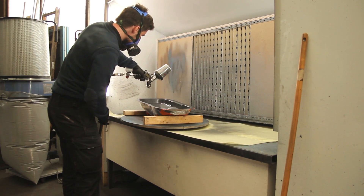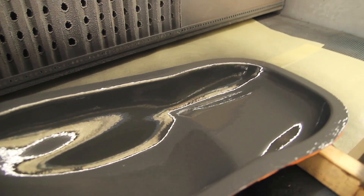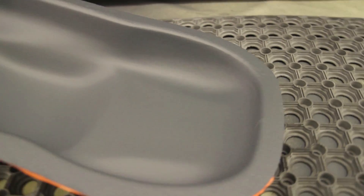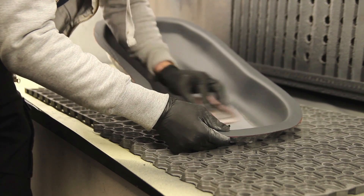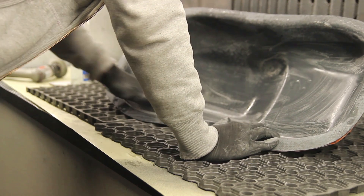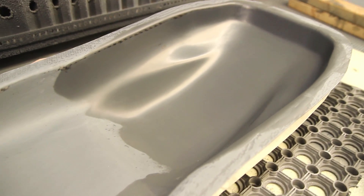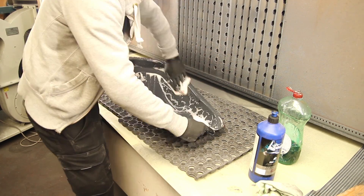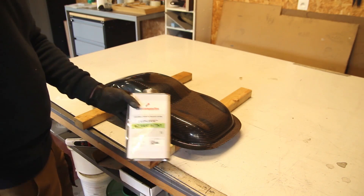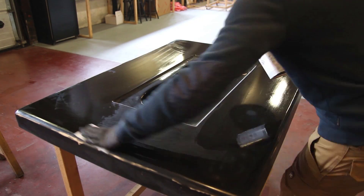Here it's all about adding the pattern primer again — I used it in the first video to make the plug, and now I'm using it on the inside. I'm just trimming the sides, leaving a little bit of cured fabric flange, because this will also be in the layup of the part in this mold. I've sanded it fully flat, applied the first layer all the way back to the carbon fiber so the peel ply finish was removed and any imperfection filled. Now I'm using a spray gun again for an even coat, then wet-and-dry sanding down to a good result — around 400 grit — then polished up for a good back-of-part finish.